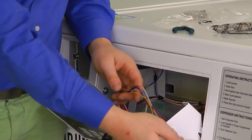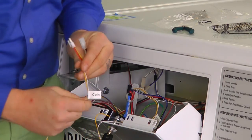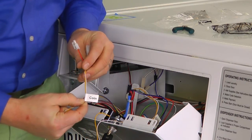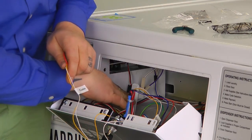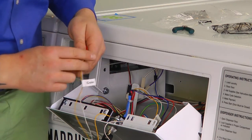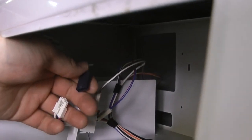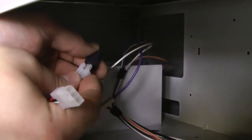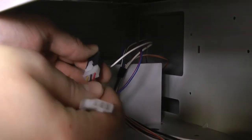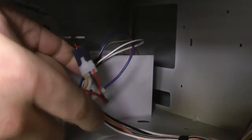The longest wires here are the white and yellow wires, and they are labeled coin. For these, we need to find the coin drop connection inside the machine — it's a little bit further back where the service switch is that pops out when you open the panel. We want to reach into this connection and unplug it, and go ahead and plug the PayRange harness right in line with it. This allows you to accurately monitor the coins that your customers are putting into your machine.